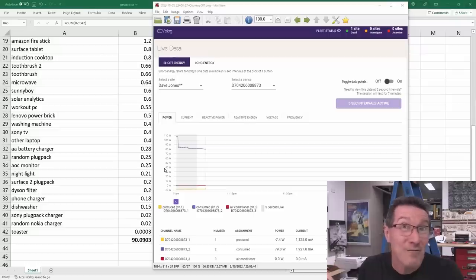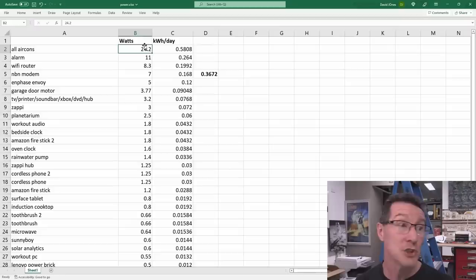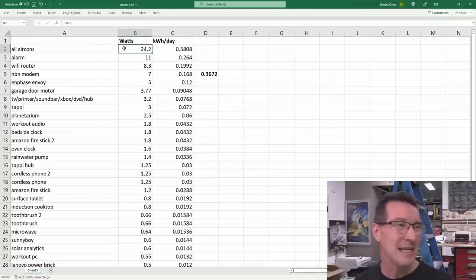I'm pretty sure I got everything in the house — I can't see where an extra 19 watts would be going. Can I actually save substantial phantom power by turning stuff off at night? Well, yes and no. The air cons are obviously chewing the most at 24 watts just sitting on standby. In winter and sometimes in summer we have the timer set for 4 a.m. for the kids. You'd need some sort of timer-based relay to switch them off at night otherwise.